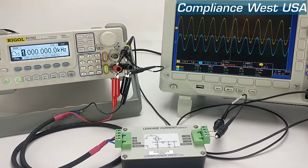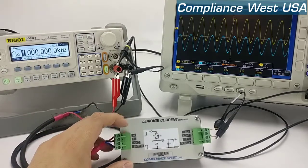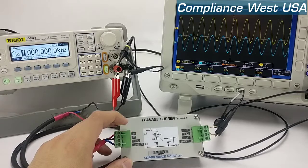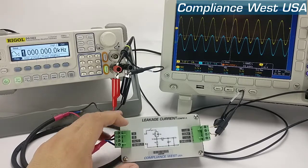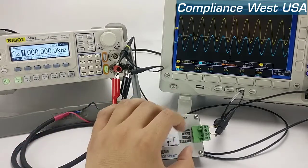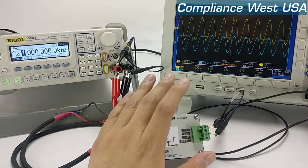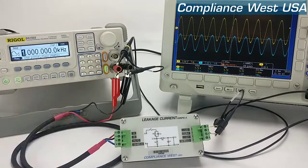Now when testing your equipment, as mentioned before, you connect from A to B — your chassis. You either connect the chassis to A and B to ground, and then take the measurement directly on the output side, either using an oscilloscope or a voltmeter.